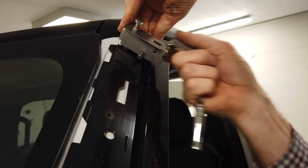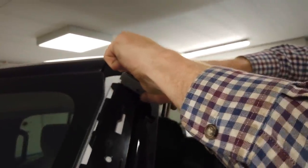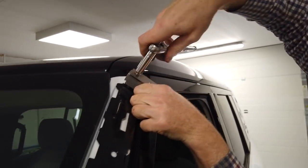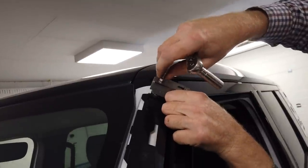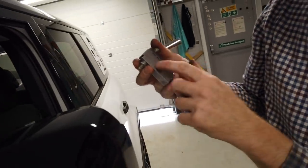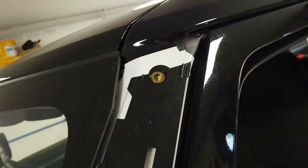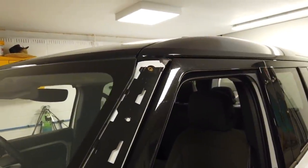That's going tight now, and as it gets tighter it gets easier. Now we've got the rivet nut tool set. If I undo the nut now it should leave us a captive nut in there — release the tool and the spacer. There we go — that's the tool with the spacer. We've got these on the website. Now we have a captive nut, which is what we were trying to do all along. A bit tricky, but that type of tool with the spacer works well.